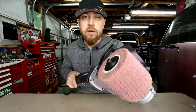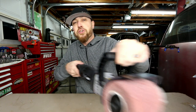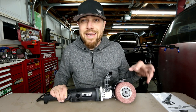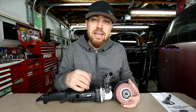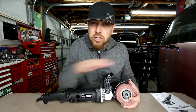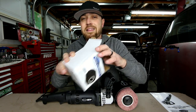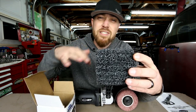This tool really does all the work for you — basically just the weight of the tool itself is enough to strip off the surface of any metal. The drum currently on it is what they consider an 80-grit drum, mainly for light rust and light paint, really made just to condition the surface of the metal and give it a brushed look. They've also got these drums which are more substantial and really made to strip off paint, heavy rust, and scaling.